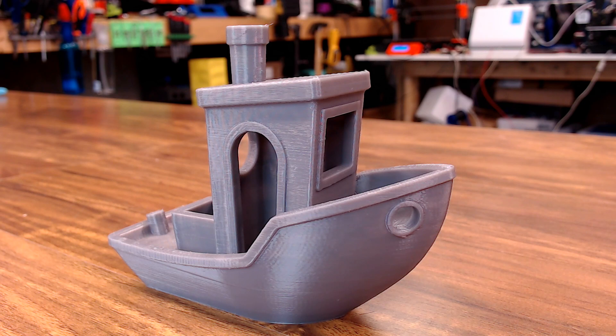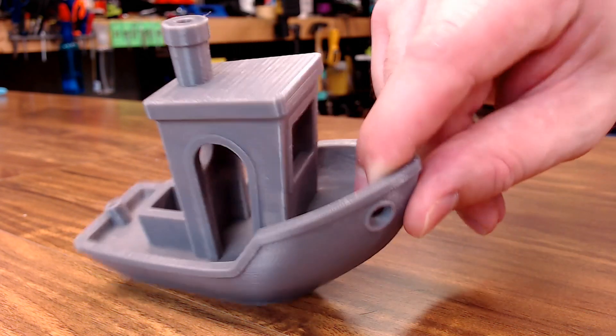The top speed on this one was just a little bit over 100mm/s with Linear Advance 1.5 enabled, and you can knock out a 200% Benchy at 10% infill in less than 5 hours. And if you go into your slicer and compare that print time with a lot of the other i3 Cartesian style machines, it's pretty impressive to do that under 5 hours and get any kind of quality. Of course, you could continue to tune and get that print time down, but I'm really happy with these results for an everyday printer.